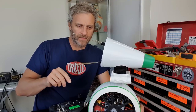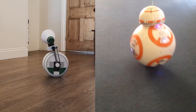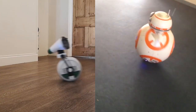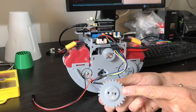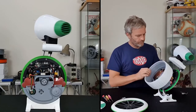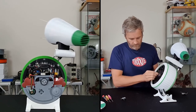On his YouTube channel, Matt Denton has a five-part video series on how he made this prop-quality, 3D-printed, remote-controlled DO droid from Star Wars: The Rise of Skywalker. The little guy stays upright using digital gyroscopic stabilization and feedback. Matt's droid is based on an original design by Michael Baddeley. His version uses the Arduino MKR family for the brains, including an MKR Wi-Fi 1010 and an MKR IMU shield that adds a 14-bit accelerometer and a 16-bit gyroscope. He tops it off with an MKR motor shield that can drive four motors and four servos. Only two of the motors use encoder and current feedback needed to keep the droid upright, but this design only needs two motors anyway.